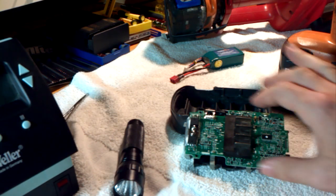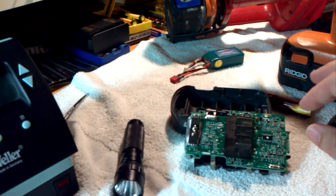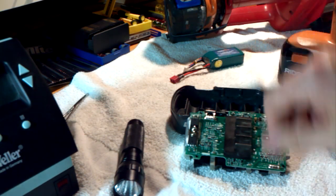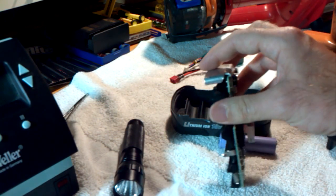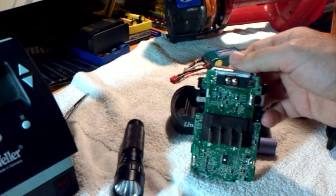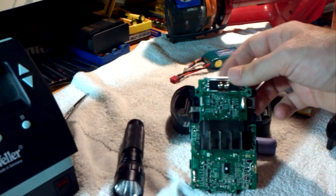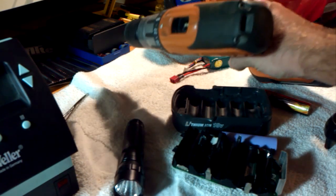If you open up one of these battery packs, it's chock full of circuitry — charging circuitry and voltage monitoring — so it makes sure the battery pack doesn't exceed a certain voltage and doesn't go below a certain voltage. That's what these transistors do; these are power transistors. This aluminum piece is a heat sink — you can see it's been epoxied because it probably gets fairly warm. If it goes below a certain voltage, these transistors turn off and stop the outflowing voltage to your drill or whatever you have hooked up.